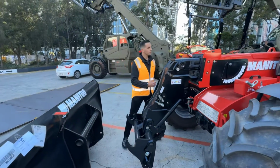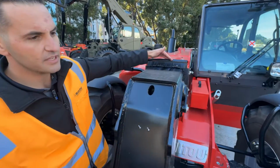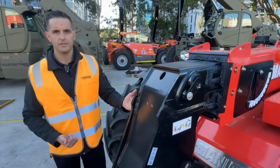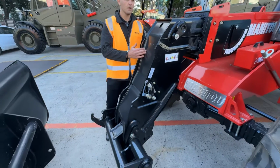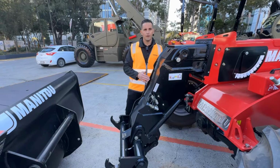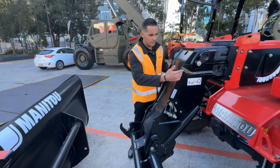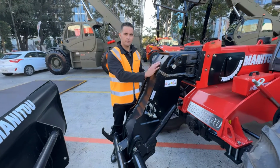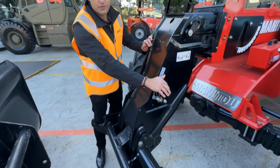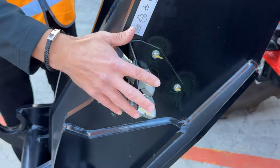When you step around and look at the boom, you'll notice material baffle brushes on the front protecting any debris getting inside the boom. You'll also notice that the boom shape, for those familiar with the construction range, is very different. This is an agricultural dedicated boom built to handle the rigors of ag, which primarily includes the use of a bucket. Bucket use compared to pick and place use is very different and very harsh on the machine. Even the positioning of the welds is optimized to ensure that this boom head can handle your day-to-day activities very well. You have your third function auxiliaries if you want to run a 4-in-1 bucket, a grab, whatever your function may be, simply off the joystick.